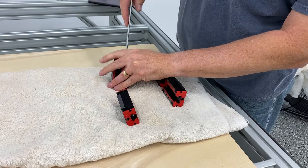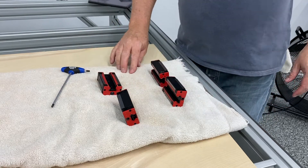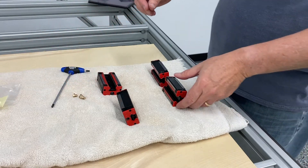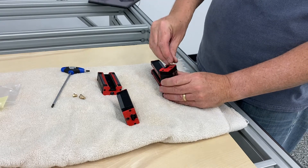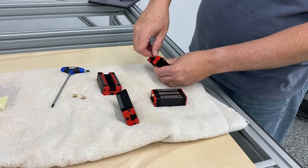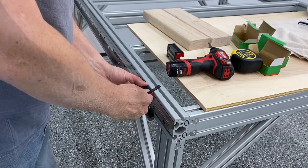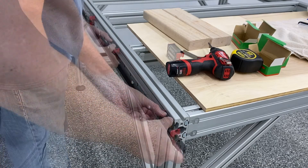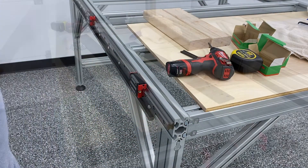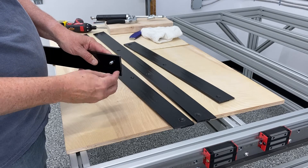The next step is preparing your linear bearing blocks — just pull them out of their packaging and orient the grease zerks to the outside. AVID calls for a very specific orientation for these bearing blocks, so make sure you follow the written instructions. I found these little zerks were a little finicky putting them on, but with a little patience I got them. Once you slide them on the rail, that little black interior piece is going to slide out, and it will be a little rough at first — that's to be expected. Once they're greased up and moving under load with the gantry, they seem to function just fine.